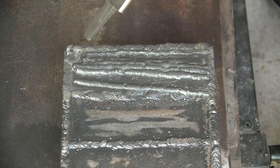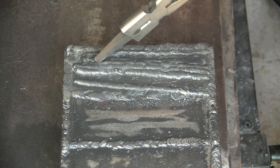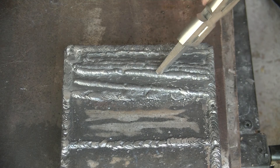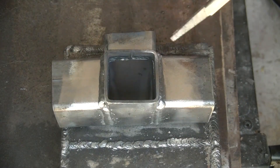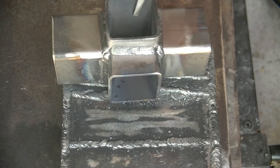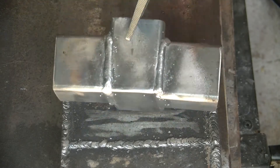You can see there are four or five beads that I've run on here. What I'm trying to do is make sure my settings are correct as far as voltage and wire feed speed. I also have to make sure my travel speed is correct, my contact tip to work distance is correct, and that I'm dragging — because if I make slag, you drag. You can see all kinds of bug holes and a junky-looking weld in that first bead, and then as the series goes down I start getting it figured out.